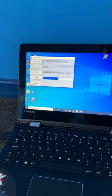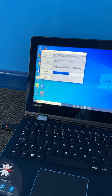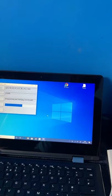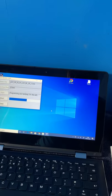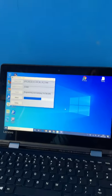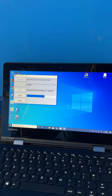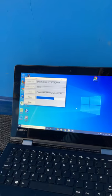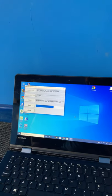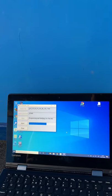So while it's doing this, I'll just answer: why would you be doing something like this? Well, you might find that if you've got a version 3 or below, the Texecom Smart Home can't be connected to it because it just doesn't give you the option when you go into UDL options to set up the Smart Home. Doing a software update should put the software on there so that you can attach your Smart Home. Probably really the only time you'd ever need it, apart from any new features with the ARC or anything like that that weren't on the older versions.